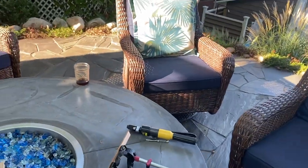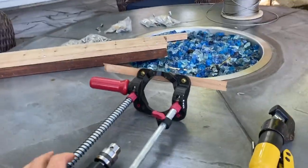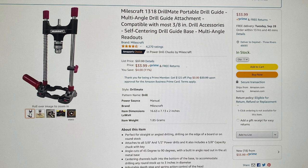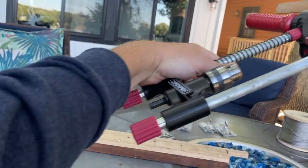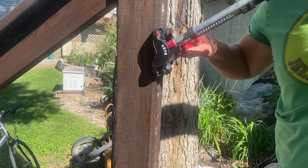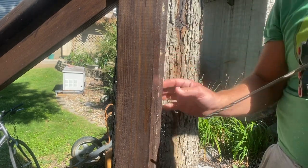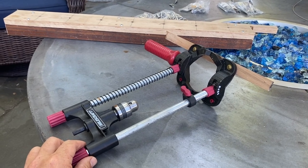The next piece is the two main tools you'll need. Since I'm doing a staircase, I went ahead and got this portable drill press. This thing is able to go onto the diagonal, pushed up tight against the post, so I'm able to bore through at the right angle. That's pretty important — otherwise when you come through the post, you're going to have different spots where it starts and ends. If you're not doing a staircase you wouldn't need this, but if you are, I'd recommend it.